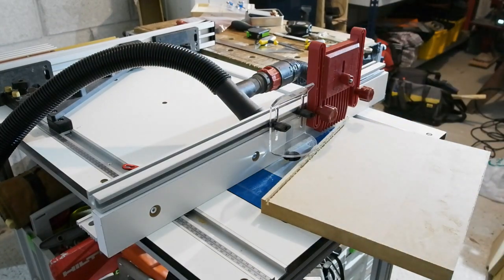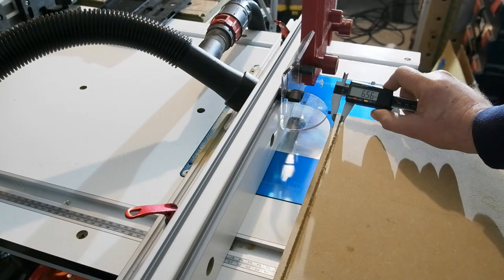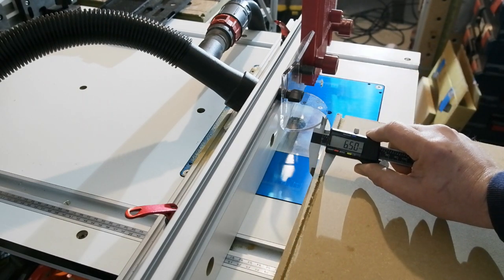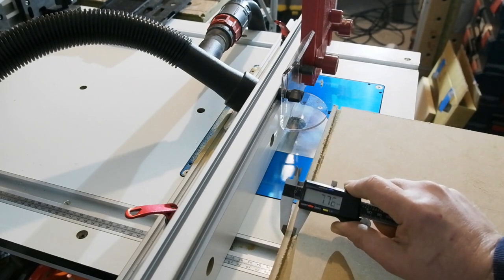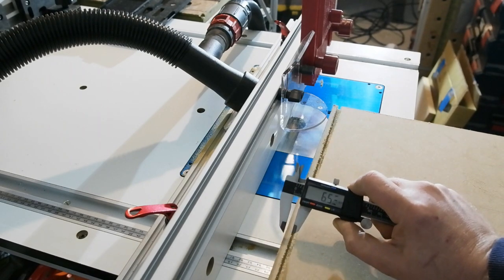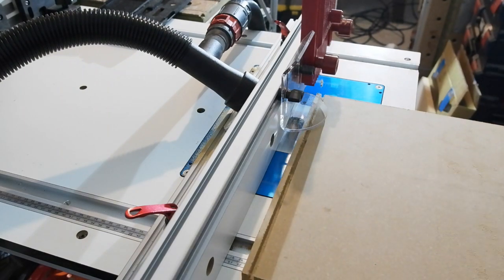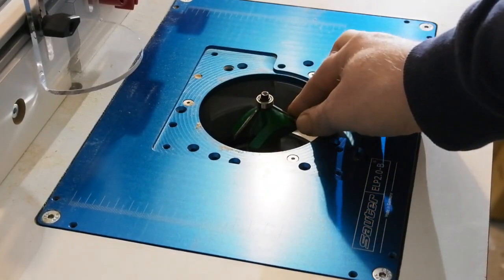Given I was aiming for an unexplainable 6.5mm, I'd say the results were pretty perfect — within 0.06mm — just using the marks on the plate. From that, I'd say you could use the etched markings on the router plate with confidence.